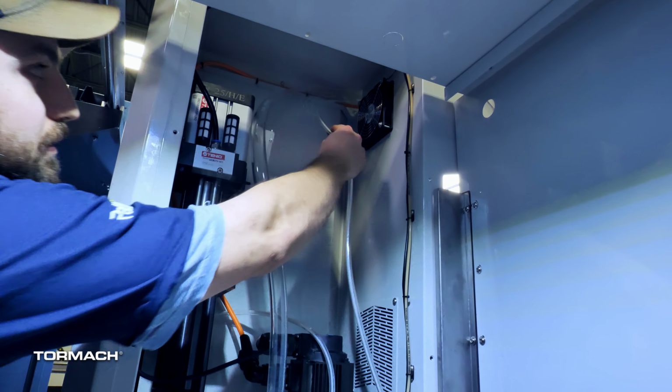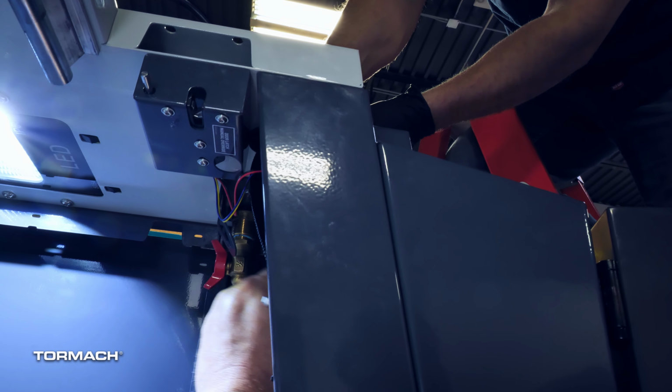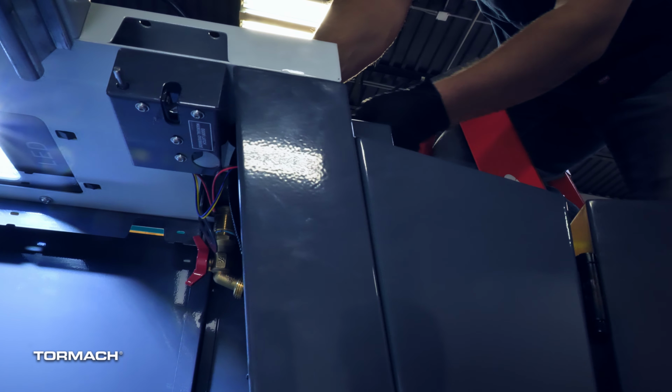Find the hose bib and wrap thread sealant tape on the inlet side. Thread this side into the bulkhead fitting. We use the end of a hex wrench in the pipe to keep it from spinning while someone tightens it from up top with a 32mm wrench. Make sure the shutoff valve is facing the back of the mill so that the shutoff can be turned off easily.